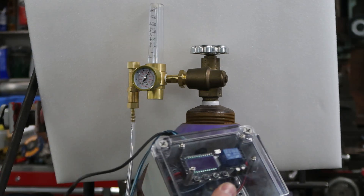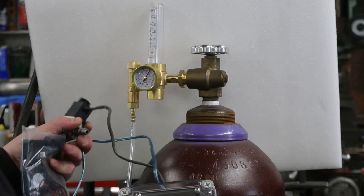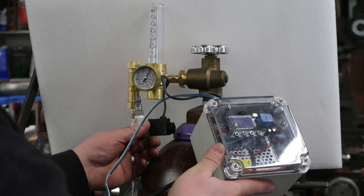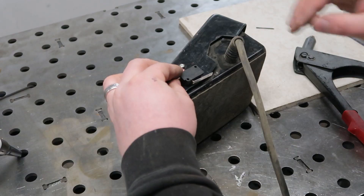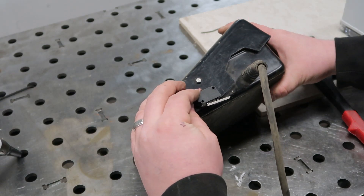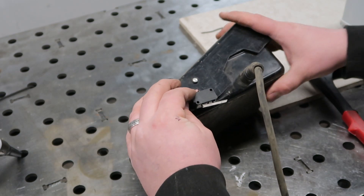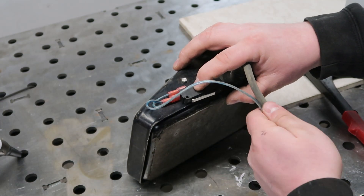I've got my purge bottle here and this solenoid is going to go in the place of where the hose is, screwing up into the bottom of the regulator. I want this enclosure to hang off of here, so we're going to build a bracket real quick. Our little switch is going to be mounted to the foot pedal. When you mount your switch you want to make sure the click inside the box when your pedal initiates is going to be really close to the click of when this initiates, so they key in at the same time. We'll find that sweet spot and put a pop rivet in this switch, then tidy it up to the cord.